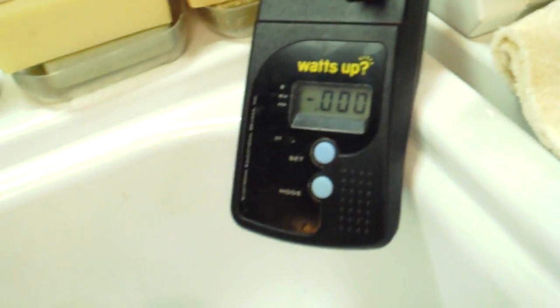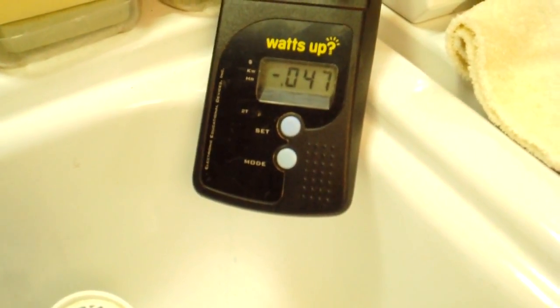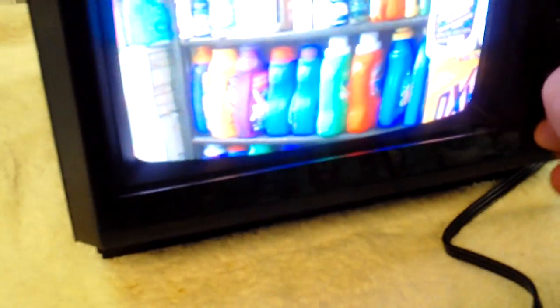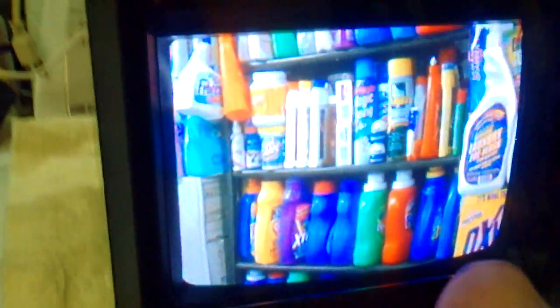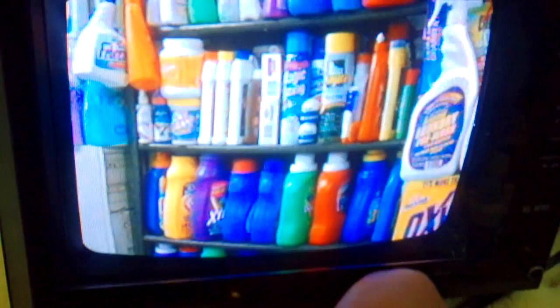Now we'll try AC. I have the AC plugged in — hopefully it's plugged in enough on the correct pins. I think it worked. Yeah, we're showing 40-some-odd watts — about 46, 47, 48. Now it's all warmed up. Looks like we have a little brighter picture now. Volume all the way down, picture all the way up, and the black level — you can see I can adjust it and it doesn't bounce around anymore, so that's definitely working the way it's supposed to. We'll leave everything right about there. I'm going to change the color from before. I'm sorry about the banding, but there's not much I can do about that.